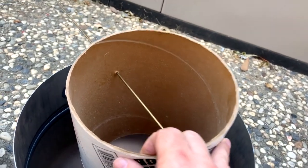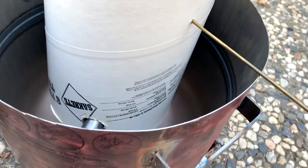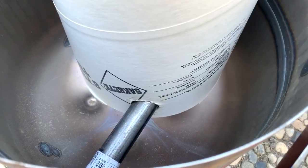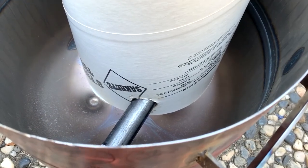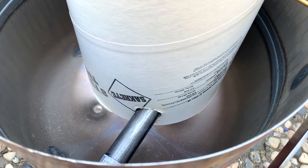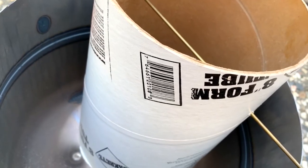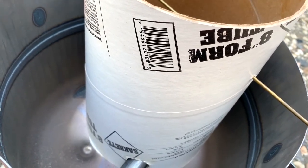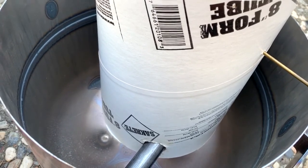This will be my furnace blower eventually, but I'm putting it in there for now to keep the space. I've got this 8-inch tube held up at the proper height with a brass rod, so I'll get this all centered. I'll pour the refractory cement in there, and then I'll remove this pipe once the cement has set so that there's just a cement hole for me to slide this in and out of in the future. So the next step will be to mix up my homemade refractory cement.